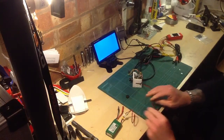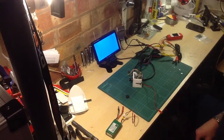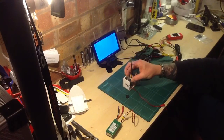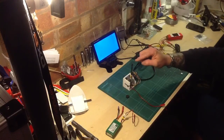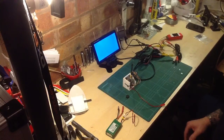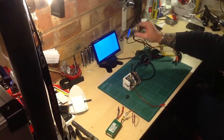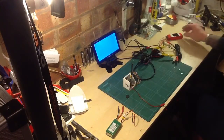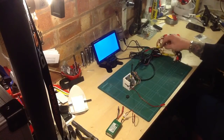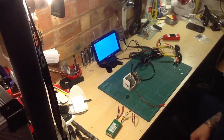So if there are any questions, feel free to inbox me or post a comment. That's a simple FPV setup on 5.8GHz with a little Sony camera and a 5.8 transmitter, receiver with a planar antenna for distance. I've done a range test on this — over 800 meters and still getting a picture in direct line of sight. Cloverleaf on top of the receiver, just one battery to power up, and not all cables are used — the blue lead isn't used on this one, it's just power in and out. Any questions, give us a shout — cheers!